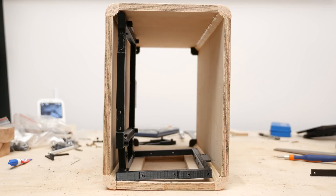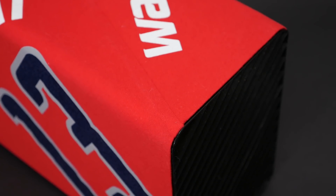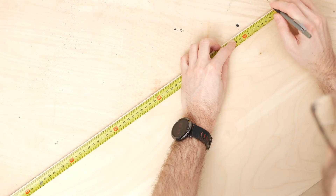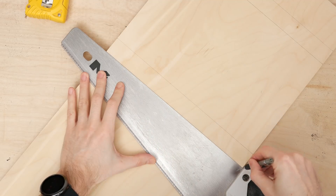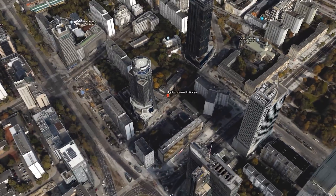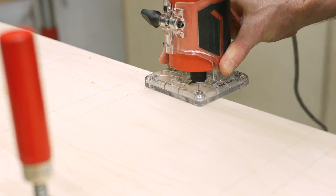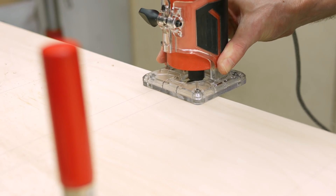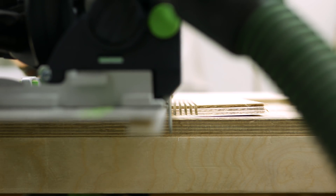The shell is made from plywood and the original idea was to bend it to get those nice round corners. So I picked up two sheets of 10mm thick plywood cut to size 78x31cm. I marked cutting points and went to a makerspace called FabLab here in Warsaw — the first time I had a chance to use power tools freely without bothering neighbors. First I trimmed one of the longer edges at 45 degrees, then proceeded with making grooves at bending points.